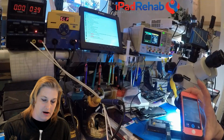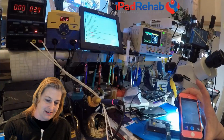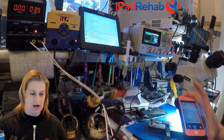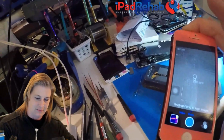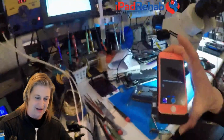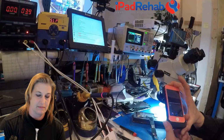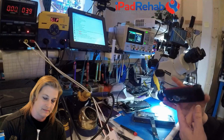All right, so far I have this thing telling me that there's a hotspot on the board. The board is not doing anything right now. It is not prompted to boot. And according to my calculations here, FLIR cam is telling me, hey, you got a hotspot. See that? All right, we better get this show on the road because it looks like the camera is running out of batteries. Probably because my typical use is leaving it in the drawer for long periods of time.